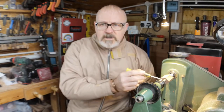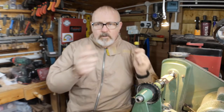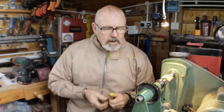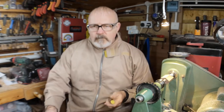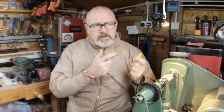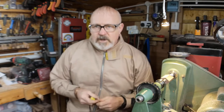We've now got the bushings, and that's basically what I turn down to. And I've also got some spacers in here, which allow me a little bit of space to work with the chisel. I do prefer using the 3/4 chisel, purely because it's what I'm used to. I do use a skew chisel as well for edging work.